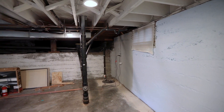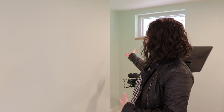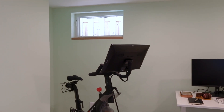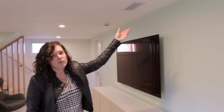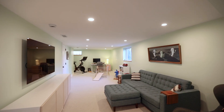Basements often present their own challenges — this one was no different. Over on this side of the room we have a wall that's bumped out simply because of an existing plumbing stack. We were able to work with our plumbing trades to tighten it up a bit, but it was in line with this window. We chose to maintain the window in the main area as opposed to the mechanical room because that was a priority for the homeowners. So we created this little nook over here — and there was also a great unintended consequence: it creates a perfect little corner for the Peloton. Throughout the ceiling we had various ducts passing below the floor joists. Wanting to keep the ceiling clean and unobstructed, we worked with our HVAC technicians to reroute some of the ducting so that it was all hidden within the mechanical room or in between floor joists above us, allowing us to maintain a smooth ceiling out in the family room.